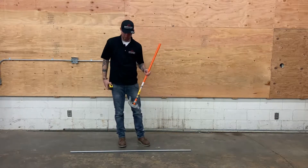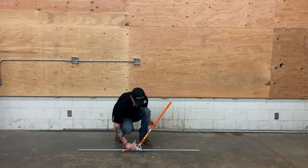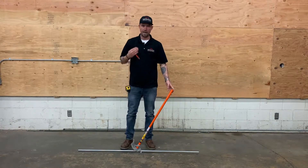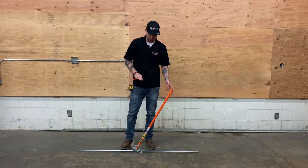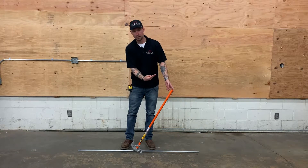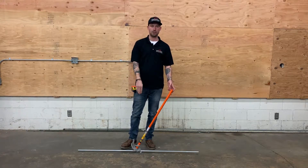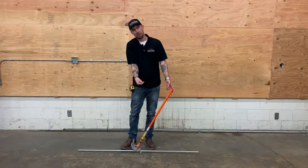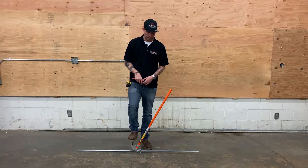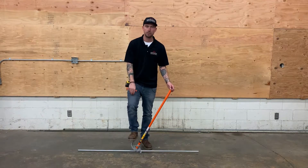Now I'm going to bend my conduit. I'm going to put the arrow on my deduction mark. When I'm bending, my main goal is to really keep the pressure in the shoe as high as possible. This will keep the conduit laying directly in the shoe and cause it to be a nice smooth bend. If you don't have enough pressure, you're going to get a ripple effect — the inside of the conduit is actually going to look rippled. To do that, I'm mostly going to be concentrating on my foot pressure. The handle is there mostly just to keep you balanced and in line, but it's mostly going to be from your foot.